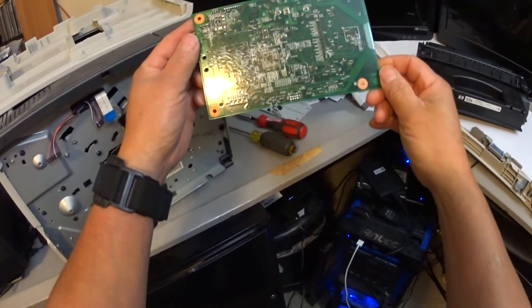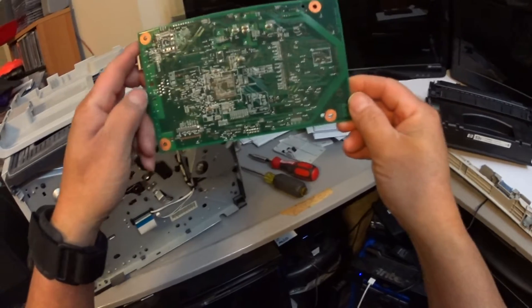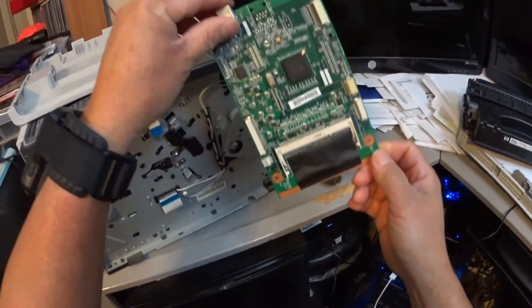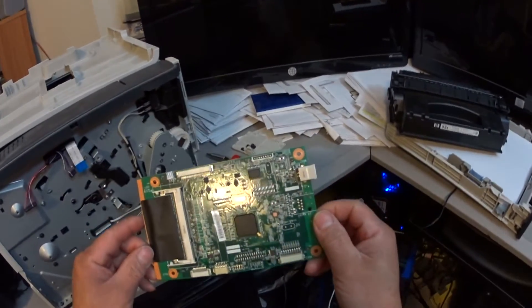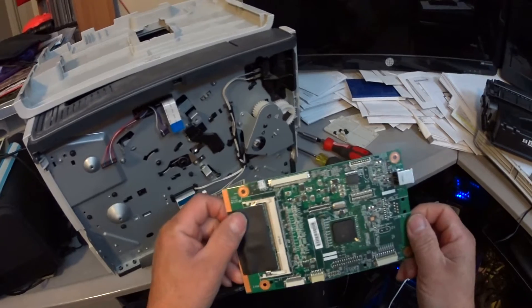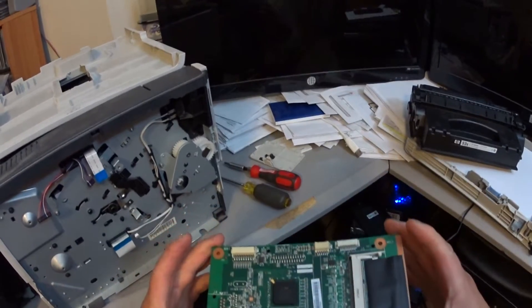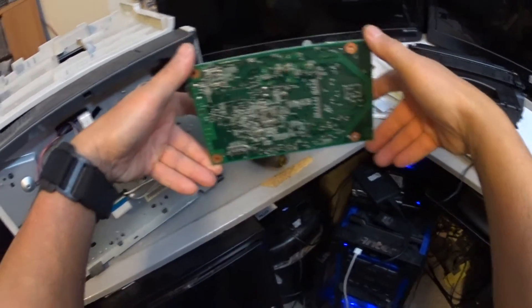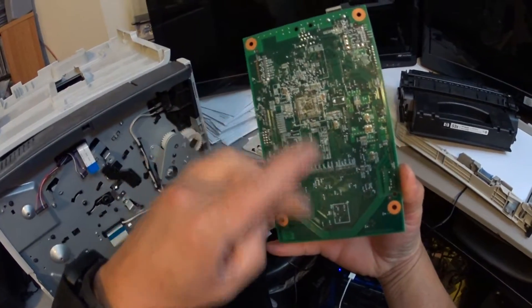And there's our board. If you look at it, it also has those microchips — a whole bunch of ceramic multi-layers — and they have big control chips at the bottom. Something's loose on the board somehow. So what we're going to do is bake this in the oven for 8 minutes at 375 degrees. You've got to make sure you suspend it somehow so some of these components are not touching the hot surface, because you don't want them to fall off.